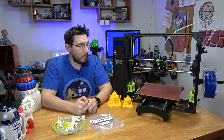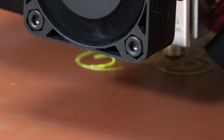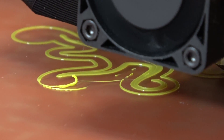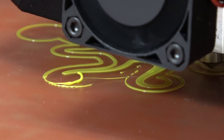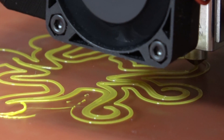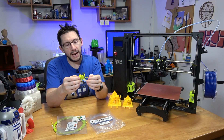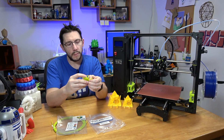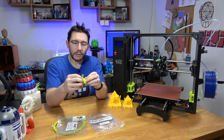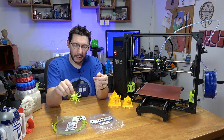Once the printer was all together and turned on, it was time to print the Rocktopus model, and it went extremely well. The NGen fed into the heater just fine and extruded just as it should. There's an actual NGen Rocktopus selection on the SD card that Lulzbot sends with the printer, so I just chose that. The automatic bed leveling worked like a champ and laid down smooth, consistent, buttery layers of ColorFab NGen and produced an exquisite Rocktopus. There is a tiny bit of stringing, but stringing is merely a temperature and retraction issue and isn't a symptom of a greater machine problem.